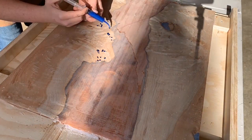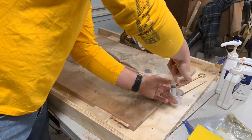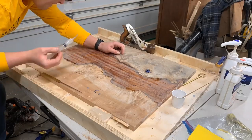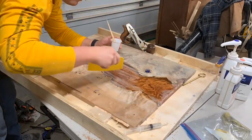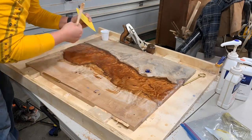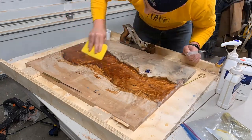And again, the dental syringe — just filling in all those holes with that really cool blue, that offset color. You can really see that pattern of the copper epoxy in the middle. Here I used clear epoxy where some chip out remained, to make sure I had a perfectly flat finish so that when sanding I wouldn't have any weird divots. I went with Total Boat two-to-one; it cured in a day. Then it was time to sand.